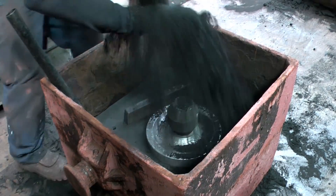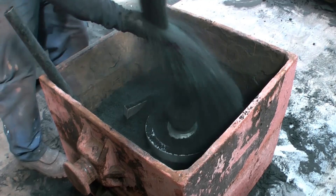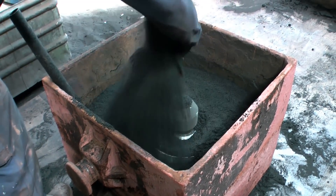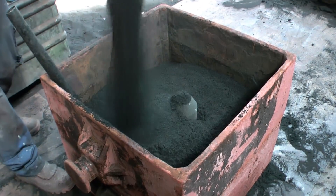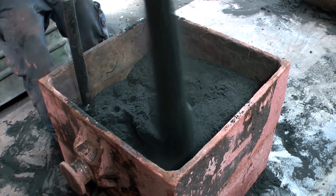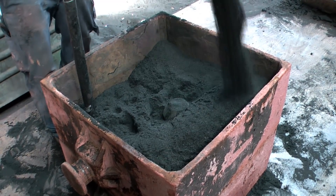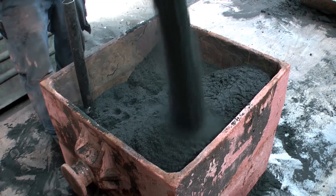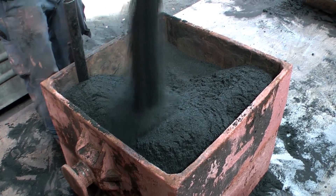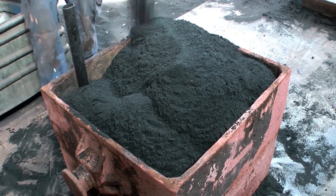On the left, an iron pipe is visible — that's the pattern for the vertical parts of the sprue. The internal feeder is covered with sand completely; it's just a cavity with an opening towards the pattern. The iron will fill this space and provide additional liquid iron when the iron in the wheel is cooling down and shrinking.